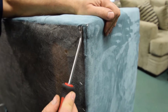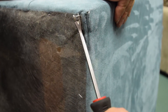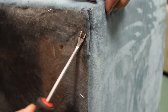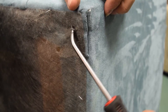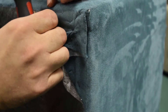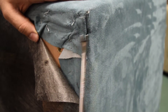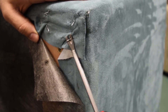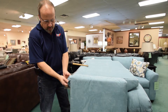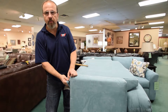What you want to do is get under the staple, pull, and twist. If you have a pair of side cutters, it will move them for you too. Now that you have your staples out, it gives you access to the bottom of the fabric, and your goal is to get the little tear or rub tucked under and below the piece of furniture.